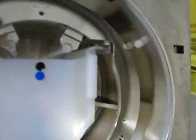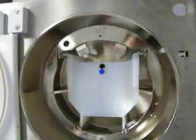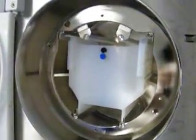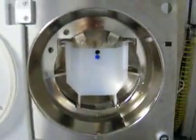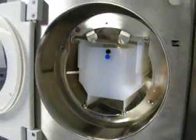So let's point it out. You've got the brand new nozzles here. The bowl, as Dave mentioned, is sent out and electropolished. The rotor you're looking at is brand new and has been balanced. It's been designed and made to meet our customer's cassette and also balanced to their exact wafer load. The customer sends their cassette and sample wafers for the design and manufacturing of a brand new rotor.